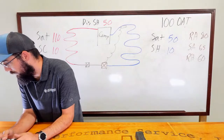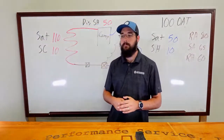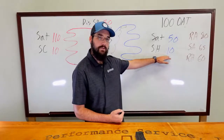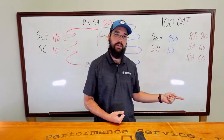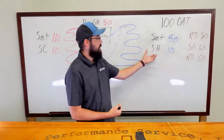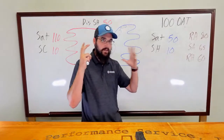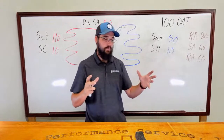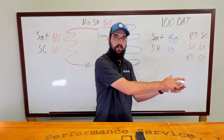It's possible that the thermal switch could weaken over time, but ultimately you've got to think, just because your superheat is coming back at a proper temperature doesn't mean that the volume of refrigerant it needs is there at that temperature. You basically slow down your airflow through your compressor, if that makes any sense. So your ability to remove that heat at an appropriate rate is reduced.